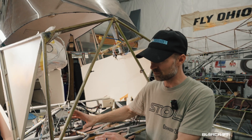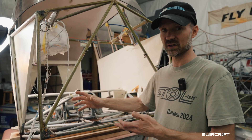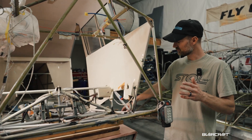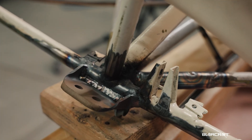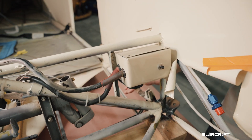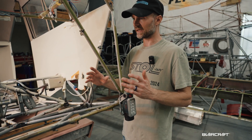Going back — if you didn't see the previous video, I had a big issue with the landing gear. I got the new Shock Monster gear and went to put it on, and it wouldn't fit. The aft gear fitting was tweaked in and up — it wasn't even close to accepting the right size bolt. Months later I found I had some major issues. There was also a buckle in the tube back there. I went up to Northwest Wisconsin to Ryan's Repair, who got me in and helped me get the Clipper to where we can start moving forward.